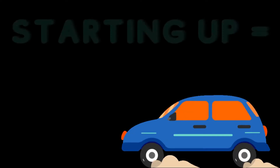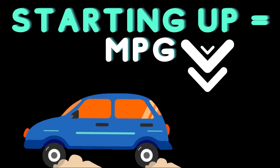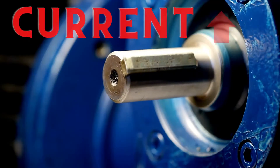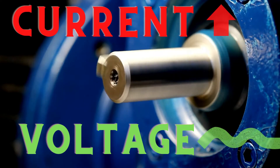Before we dive into the circuit build, I'm going to tell you a little bit about what capacitors do in circuits. Maybe you're familiar with the fact that a car burns more gas per distance traveled on startup than it does while operating at steady state speed. Electrical motors have a very similar phenomenon — when they start moving, they draw more current, and that can cause fluctuations in voltage in your circuit, which can damage electrical components or cause them to not work properly and precisely.